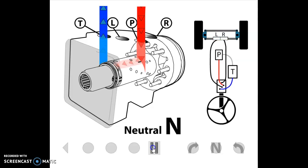Now we're going to see a 3D animation. Here's what's happening in the neutral position. This particular tractor uses an open center control valve for steering with a fixed displacement pump. In neutral, with the operator not steering, oil flows from the pump in through the housing of the valve, through holes in the sleeve, through a slot in the spool, and then out to tank. We don't want any oil going to the left port for left steering or the right port for right steering — we're just going pump to tank.